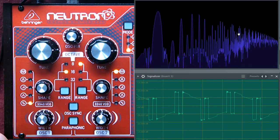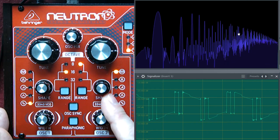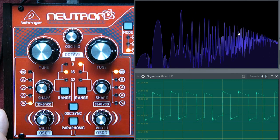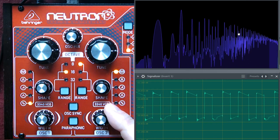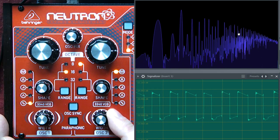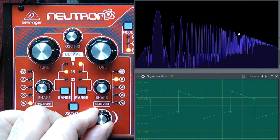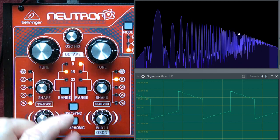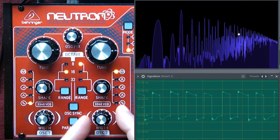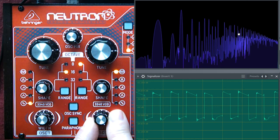But let me engage the pulse width knob even with this wave shape. Starting at the rightmost position of this knob, we get a square wave with nearly double the number of cycles compared with the real square shape. Let's show it. The real square. And now ToneMod with the pulse width knob completely to the right.